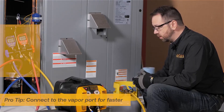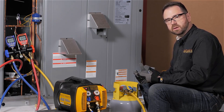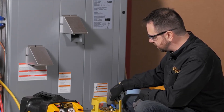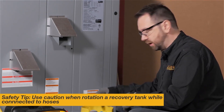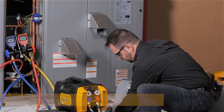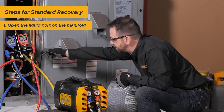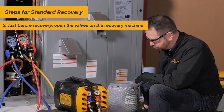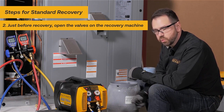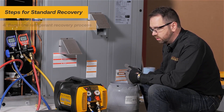Since you're pulling liquid out of the system first, you want to fill the tank from the bottom up — so flip the tank. Open up the tank, which will suck in a little bit of the refrigerant from the already-purged hose. When flipping the tank, rotate it in a direction that will tighten the fitting — you don't want to loosen it and get refrigerant in your face. Now with the tank upside down, open the liquid port from the system to get things ready. Make sure you've tared your refrigerant scales so you can monitor the whole process. Now it's time to begin recovery.